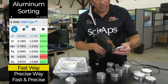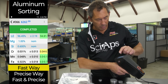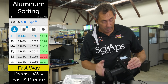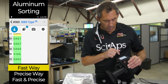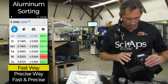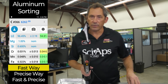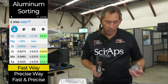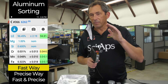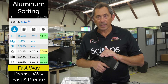This is also set up to cover some of the more oddball stuff. I like to show this 6262, because this aluminum alloy has both lead and bismuth in it — lead is often a big problem and sometimes bismuth as well. You probably want to know if there's lead in your 6000, which means it's a 6262 type. So the message here is: if you see pretty much the common stuff in your facility, for most things you could probably get away with that quick one-second test to sort your aluminums.